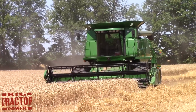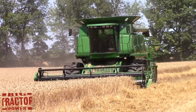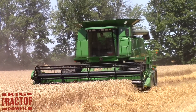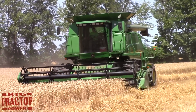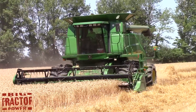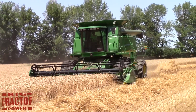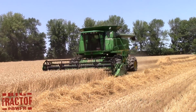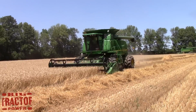The John Deere 9650 Walker Combine was a Class 6 combine, and that was a pretty big machine in the early 2000s. The only thing larger than the 9650 in the 50 series lineup of combines from John Deere was the Class 7 9750 STS rotary combine. The 9650 combine is powered by a 496 cubic inch, 8.1-liter PowerTech John Deere engine that is rated at 275 horsepower.